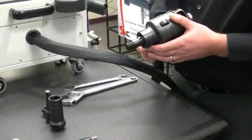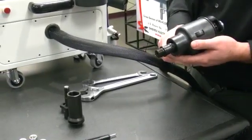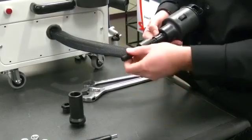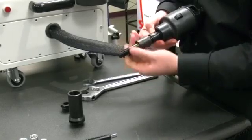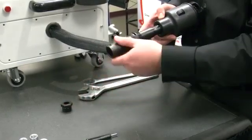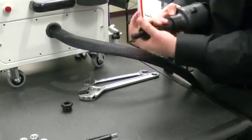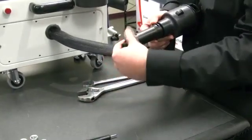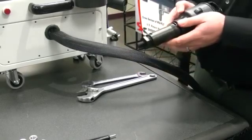For thread sizes larger than 12 millimeter and half inch, you'll have to use a special mandrel. As you can see here, I have removed the nose piece and the socket head cap screw setup. With larger sizes, you will take the special mandrel, thread it onto the tool, tighten with a wrench, then take your nose piece, place it over the mandrel, thread it onto the tool, then take your anvil, place that over the top, and adjust the thread length for the rivet nut that you are installing.